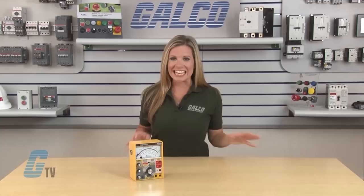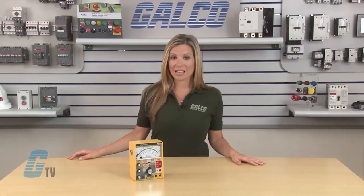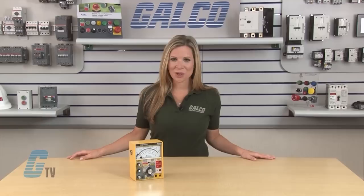The railroad tester can directly measure code parameters in any AC or DC range. They are compatible with older test technology with additional features not found in the earlier test sets. These models have simplified and expanded the measurement of relay contact on time and require no adjustments.